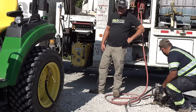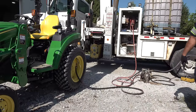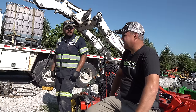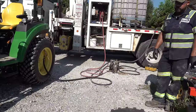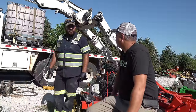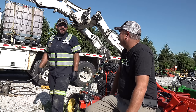Uh-oh — he sucked a little bit too much air out of it and it popped off the bead. Another reason why we like air-water valves — I didn't have to pack it full of tire mounting compound or soap or anything. Just stuck that straight through on there and it swells right up. We've had farmers before where they come in needing a right rear tire replaced, and we tell them they need to work on the left rear too — it's flat. They say no it's not, I drove it in here. There's so much RimGuard in it, it forces the beads out. He didn't realize there was no air in the tire — he had a couple of thorns in it.